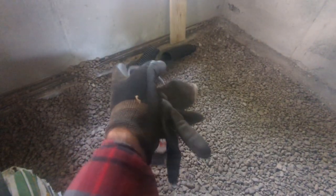So will I notch out the footer for that? Probably. I don't think it's worth trying to drill in from the side and from the top down and keep a piece of concrete across the top. I'll just cut into it with my gas wet saw, you know, 6 to 12 times in that location as deep as I can before I touch the wall. Then I'll just snap those all off, and I may have to chipping hammer out the bottom corner of it, but I'll be able to roll up and come inside of what will end up being the framed wall here for that, which will keep it nice and clean and straight going over, make a left and go right out.